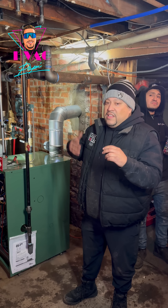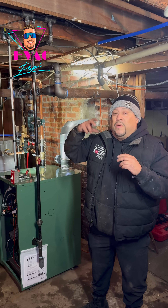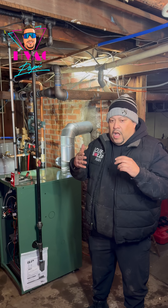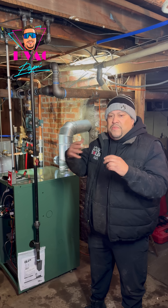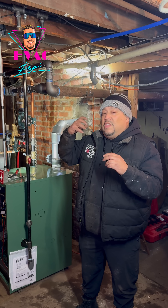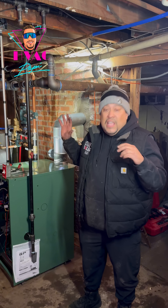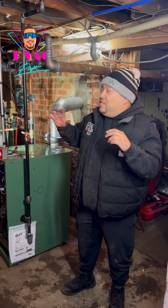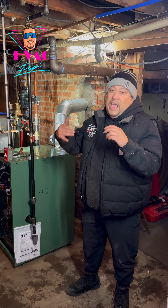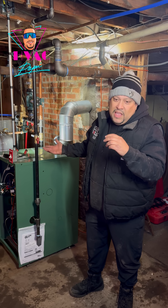Stay tuned because once you see it you'll have a better understanding of what's going on. I have to compensate for gravity and the volume of water in these pipes, which is why we need a stronger pump. A 007 or 0015 will get the job done to a certain point, but they're not moving the water fast enough — you're fighting gravity and the weight of the water. This is all about math. I look it up in books, on the internet, and I ask my vendors and my network when I need help. I do forget things, but those resources are always there.